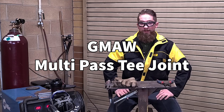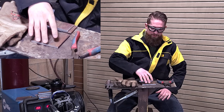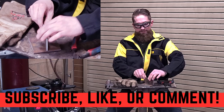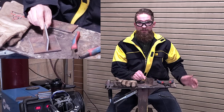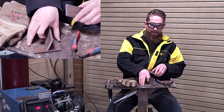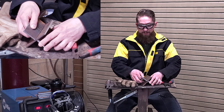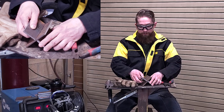Today we're going to talk about the multi-tee, weld number four. We're going to grab two two-inch pieces and one four-inch piece and make an X. You could do a multi-tee on a T-joint just flat on the table, but I find that harder because gravity affects the side of the weld, causing it to slouch out. When we make an X and prop it up, it's a bit easier to understand how we sequence our metal, and it gives you four opportunities to get a good score.